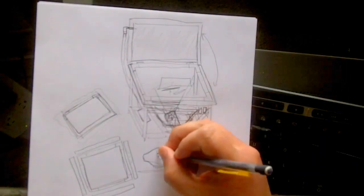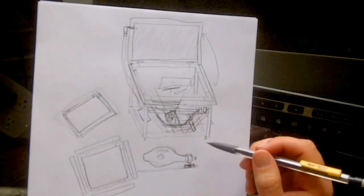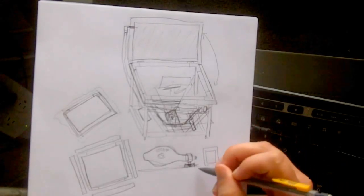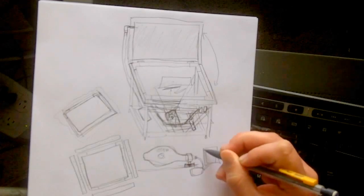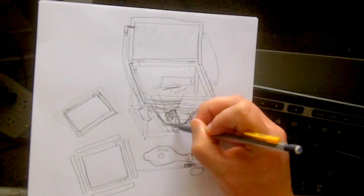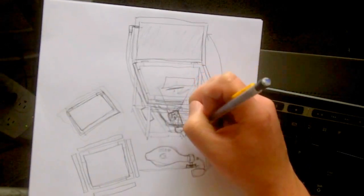So again, this is a 1,000-watt bulb that I got. I did have to order it online. They do come in kits with a ballast, which is a big box like this, and there's a little starter that looks like a little metal thing that you do have to wire together. This ballast gets very hot. I do have a fan installed right here on my unit so that the air goes in, and the back of my unit is open so that airflow goes through and then pushes out the back.